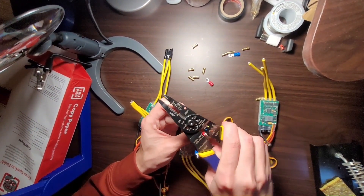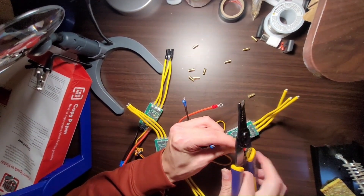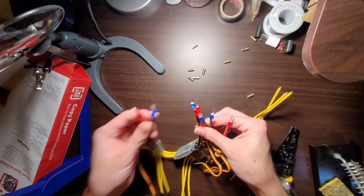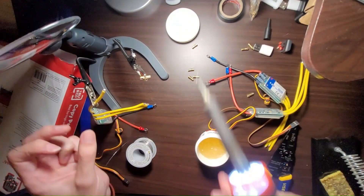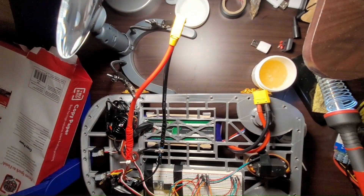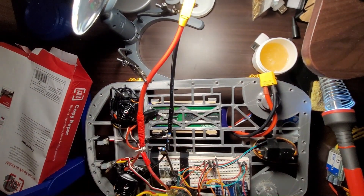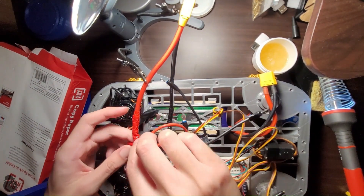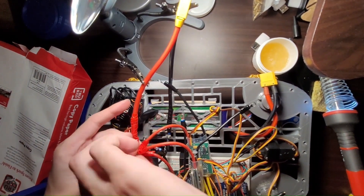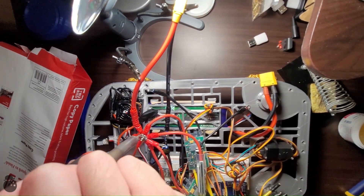To pull this off will require more electronics. The most direct and efficient way I'm envisioning this being possible is with four flying apparati located at each corner of the vehicle that are either recessed or hidden and only apply thrust when activated. Of course this means a lot of soldering - like a lot. With the electronic speed controllers soldered up, I needed a way to integrate them into the car and deliver each with the power it would need to drive its motor. My very mech-y approach was to slot the individual ring terminals of each ESC onto a bolt, clamp down on that bolt with a nut to help ensure contact, and then drown the connection in solder, making a big ball of metal conductance. It'll probably work, right?